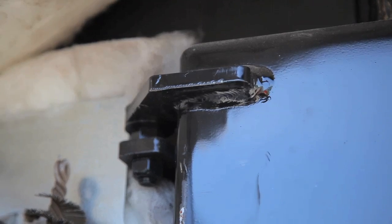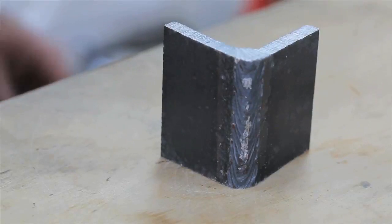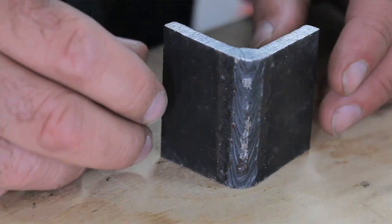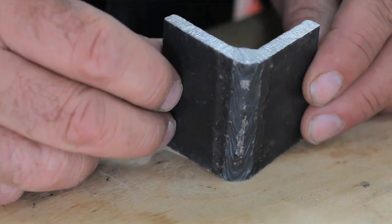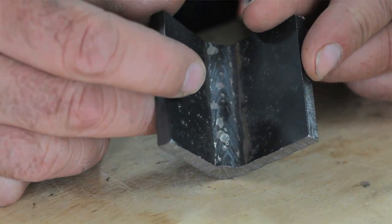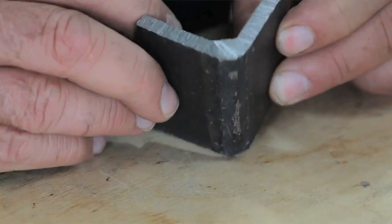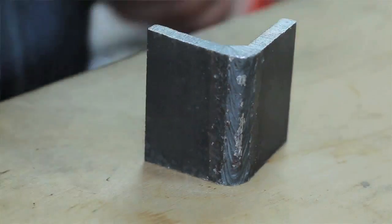I'm a stickler for craftsmanship and details, and that's one big reason why I chose to buy a Portage & Main boiler for my place. One of the first things that struck me was the precision of the laser cut parts that you see on this unit. Another thing I really liked was the double welded joints inside the boiler itself. This means that both sides of each joint have a weld bead. This makes for smoother, stronger construction, but it also eliminates gaps and cracks where corrosion might ordinarily start.